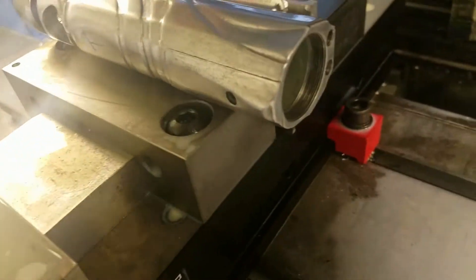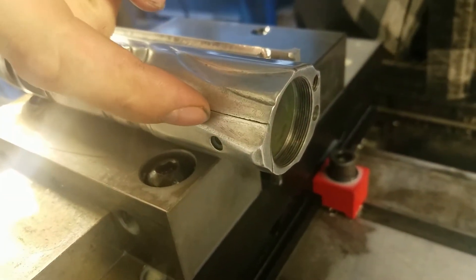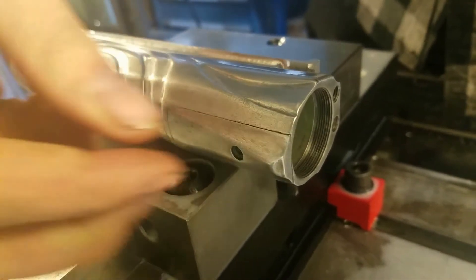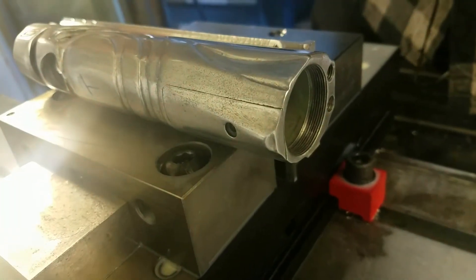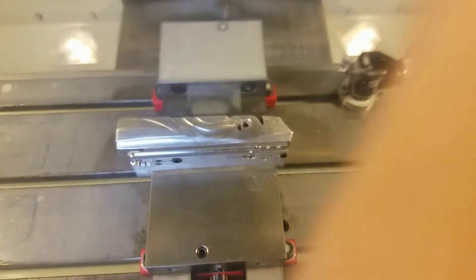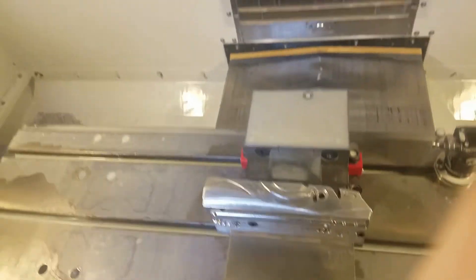In fact, I've done very similar mounting operations on 4-axis stuff and on 5-axis stuff, and it's really not that big of a deal. The only thing you have to do is make that upright plate. It looks like this thing is in there in the correct position — I believe I'm ready to go. This little piece of material is bolted on from the factory so I can't get it off. There's a little screw that normally holds it on — I took the screw out and tried to beat it with a little chisel and a hammer, and I can't get it off. So I'm just going to go ahead and do the roughing operation and hopefully it'll get thrown off on its own.